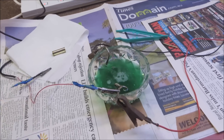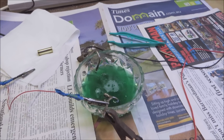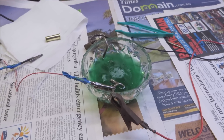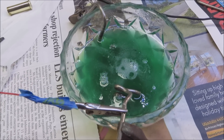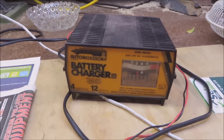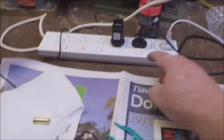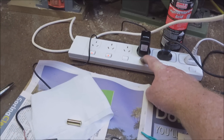G'day all. I've had a lot of questions about home plating — people very much like seeing the photos, but they've asked if I could do a video showing how the plate actually goes onto brass. You can see the setup here bubbling away nicely. I showed you how to make the solution up. I've got the 12-volt battery going to the cathode and the anode. Now I'm going to turn off the 12-volt battery charger and turn on the very low voltage mobile phone charger.